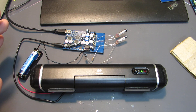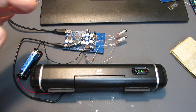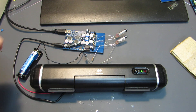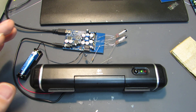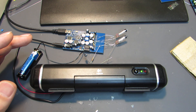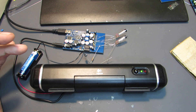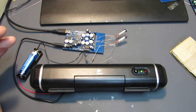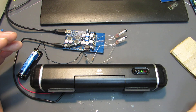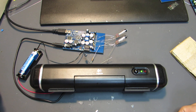Actually, the gain is not so high. And at this moment I just exchanged the triode tube with this VFD, so the parameters are not optimized, but it works as an audio amplifier. Very interesting.